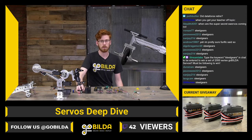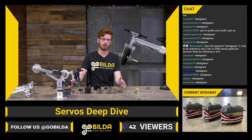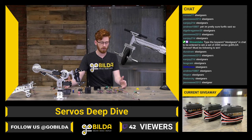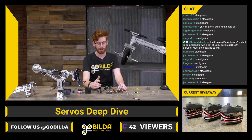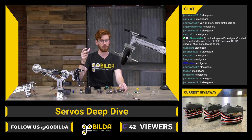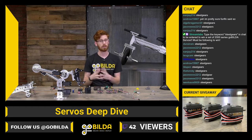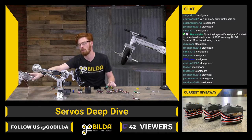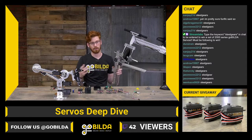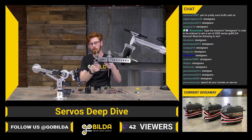One thing a lot of teams ask me is, how much money do I need to spend on a good servo? And how long should I expect that servo to last? That's always a tough question to answer, because you might want to run out and spend $180 on a 9382. Like, that's going to be a freaking awesome servo, but in most applications it can be wasted. And you can look at solving that problem in different ways. Where one team might solve that problem with a $200 multi-turn servo and a winch pulley, another team might solve it with a 180-degree servo and a linkage.